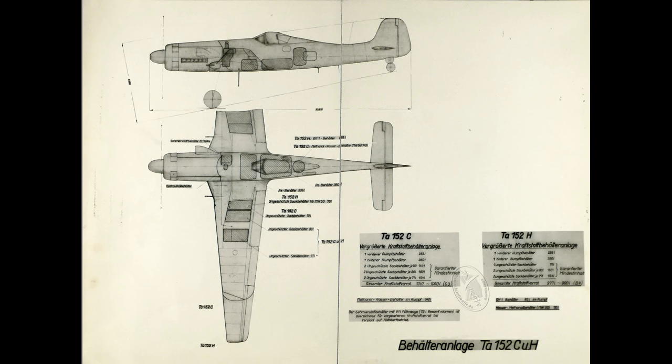The TA-152's cockpit is a little bit of an odd shape, and among aircraft that aren't round, even modern ones, 5.29 is a pretty good number. And what it means is it makes the air pressure in the cockpit 5.29 psi higher than outside. Now, that's good enough to hold that 8,000 meter cabin altitude all the way up to the aircraft's incredible 15,100 meter, which is 49,500 foot ceiling. Note, as I mentioned earlier, some sources put the plane ceiling at 48,000. Either way, it has enough pressurization range to deal with it.